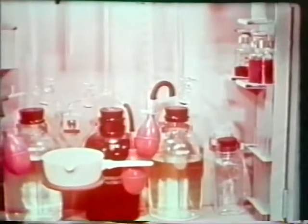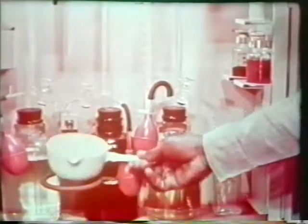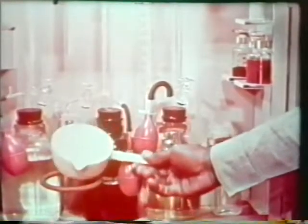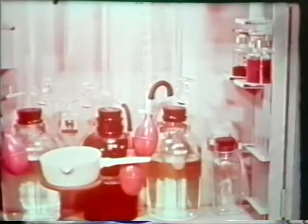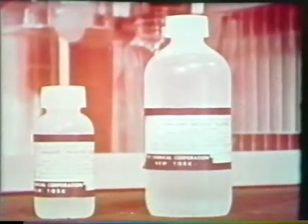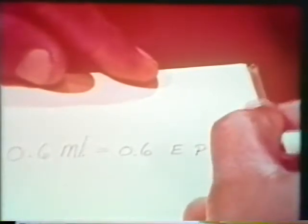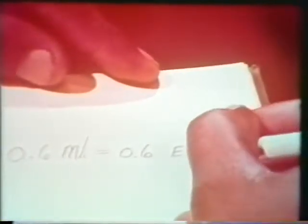Accurate testing requires proper care of the test cabinet. Before and after every use, clean each piece of equipment thoroughly. To check the accuracy of the reagent, use the standard solution supplied for this purpose. Only by careful performance of the test procedure and proper care of the equipment can you obtain the necessary accuracy in the chloride test.